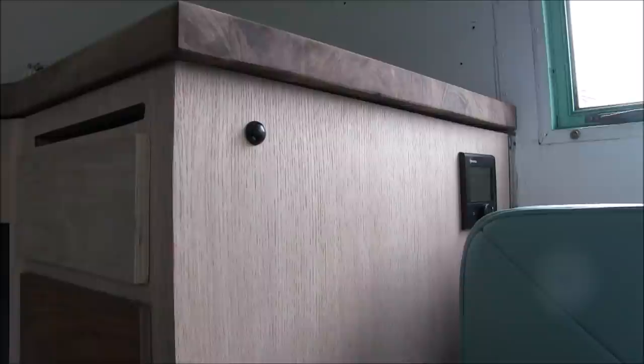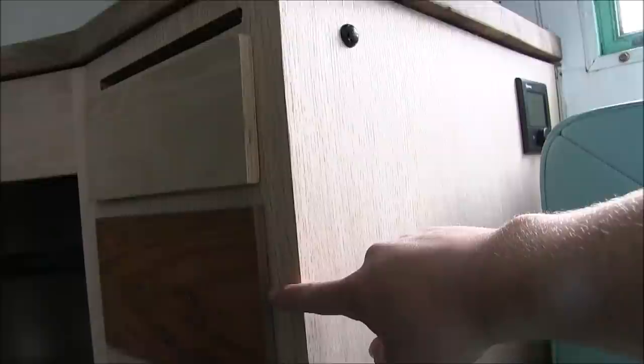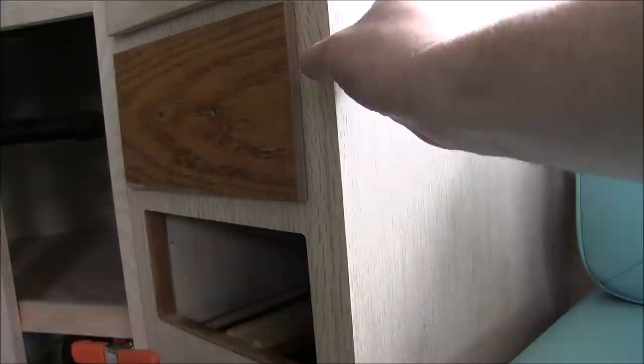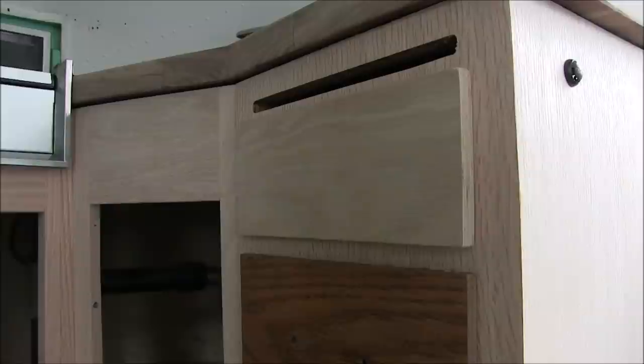You've got to make sure it's adhered very, very well with no bubbles or wrinkles, and make sure it's perfectly square. Then you take a router with a bit that's made specifically for laminate and veneer, and you route the outside edge. It has a ball bearing that runs on it and it will cut really, really clean. Once I did that, I went to the front cabinet area and did the same exact thing.